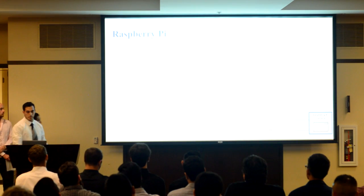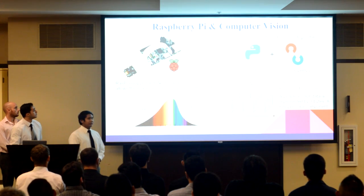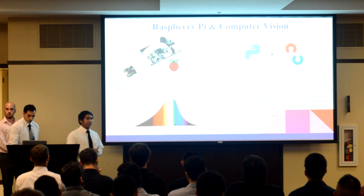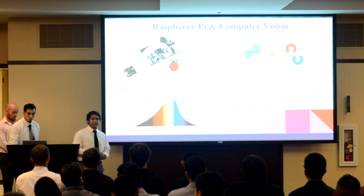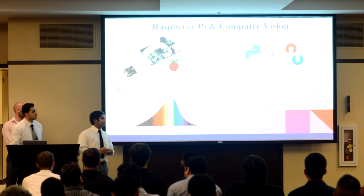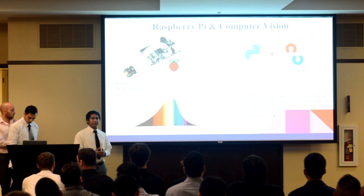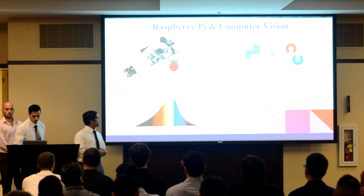Thank you, Shervin. For our flame detection system, we designed it using the Raspberry Pi, which runs a computer vision software that we developed to find flame detection. Our computer vision software involves the capturing and processing of infrared light frequencies. As you can see, infrared light frequencies actually reside outside the visible light range of the human eye. Therefore, we had to equip the Raspberry Pi with a specialized camera called the Pi camera, which has specialized sensors in which it can capture infrared light frequencies and send that data to be rendered by the Raspberry Pi's GPU.